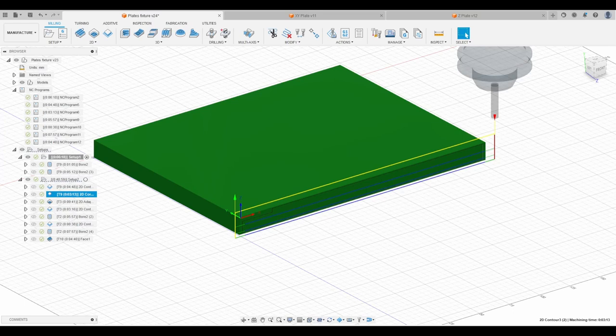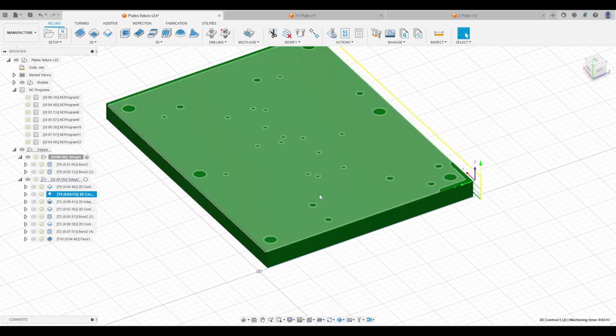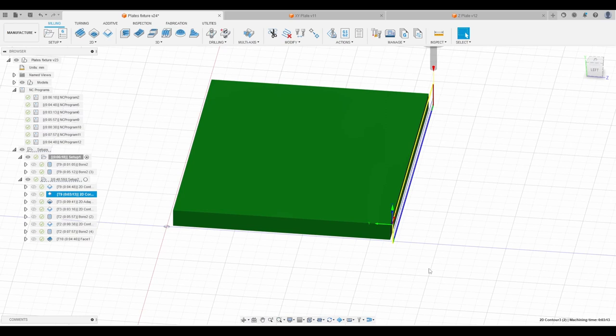So at this point, things started to go wrong. I tried doing the front side, and basically once again doing a contour with my 5mm end mill as before. But the problem was, this was outside of machine limits. As I was able to get to the backside, and now out here I only had 1.5mm of stock instead of 3.5mm of stock, I once again did a questionable thing and just flipped the stock by 180 degrees. Since at this point there's nothing important done yet, and we're still only trimming down the rough stock sizes, I figured I'd just flip it and do the backside as I did with the front side. But that didn't go as planned either. You'll see why in a second.